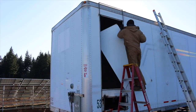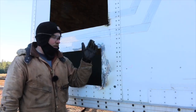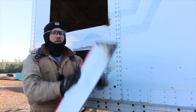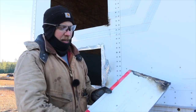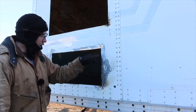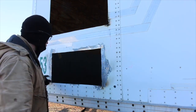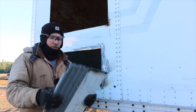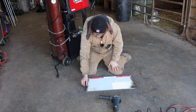Something unexpected here — this is a custom job and I'm learning as I go. I thought there was a structural beam on the inside but it's actually a joint and these are SIPs. So we're going to pause before cutting the other side, take up this panel, grind off some metal, and cut the tubing that was going to go in here. A frame will be built inside and the door mounts, and we're going to weld that frame both on the inside and outside of the trailer. I've never welded this thin metal before, so let's head up to the shop and make sure the plan can still be executed.